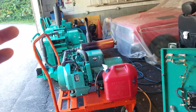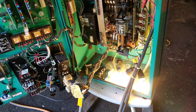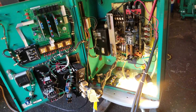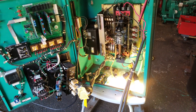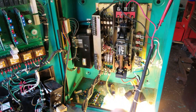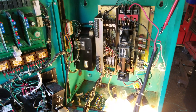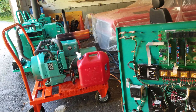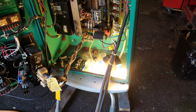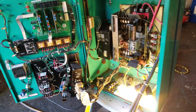The problem existed when I restored power on the line side — as if the power failure was over. The transfer switch did sense power from the line side and the lights indicated it was re-transferring, but it actually wasn't — it was sticking on the generator side. Now I'm going to restore the line side and click up the breaker. There's a slight delay... the generator is re-transferring, generator's shutting down — boom! Our lights are still on from the line side. After that bar snapped upwards and you heard the big click, this transfer switch is now working 100%.